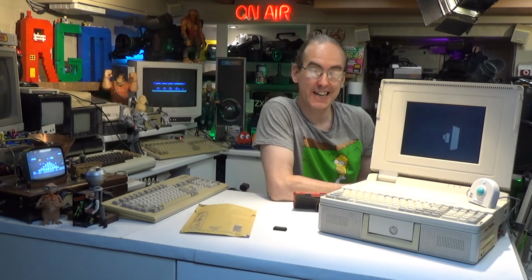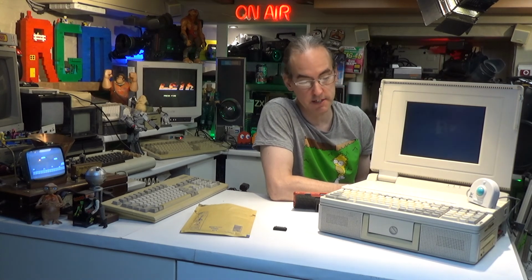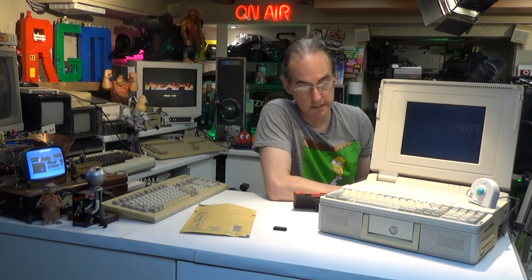Well, what a disappointing ending, especially for me. I think this is probably the first video I've done that's a bit of an anticlimax, to be quite honest. I've run TopBench and Cache Check, and they've both given disappointing results. In fact, I got the same answers I did before I installed the Turbo Cache module. TopBench is basically saying the same score of 121, and Cache Check is just recognising the onboard 8KB cache that's built in the CPU itself.